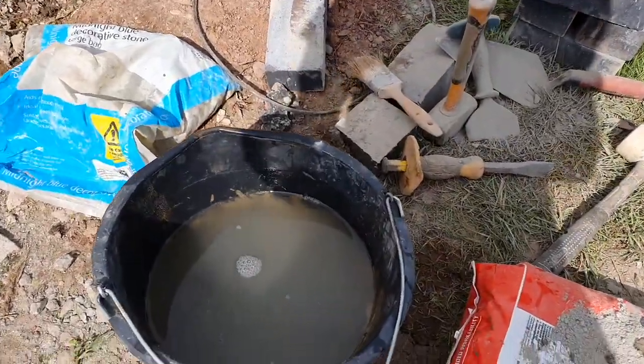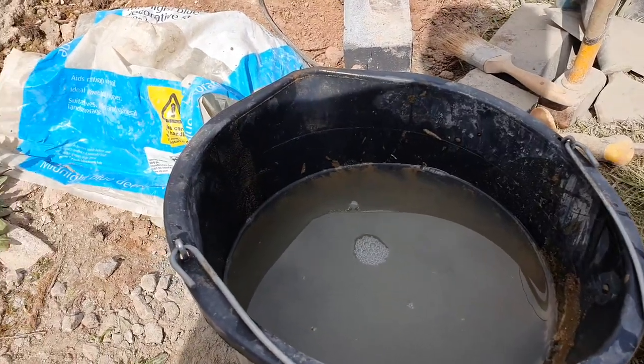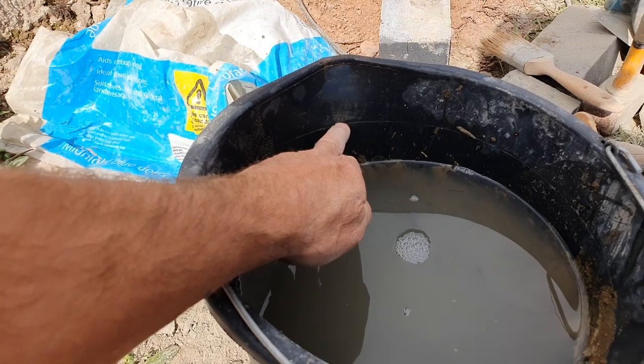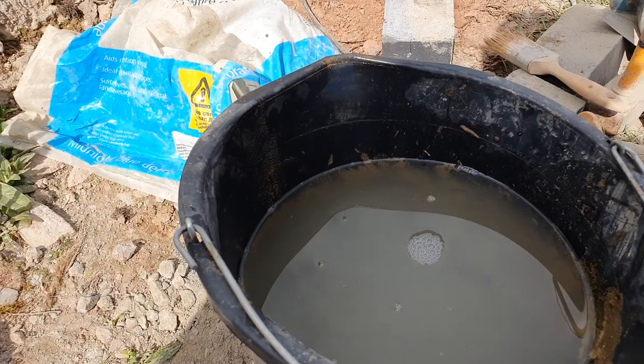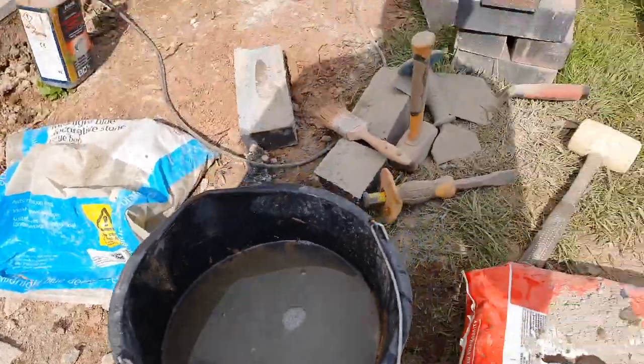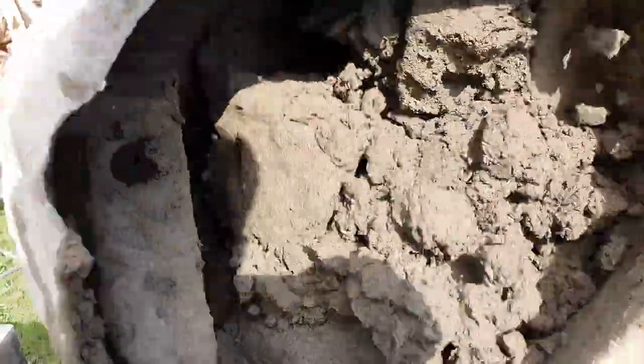This is what I've been talking about - how much water you actually put in your mix. This bucket was filled up to that line there, so I haven't even done less than a quarter of a bucket. The mix we've got is using a ratio of five to one - five sharp sand, one cement - with just a little bit of plasticizer and very little water content, because too much water actually makes your bedding mix weaker. Just allow it to mix.